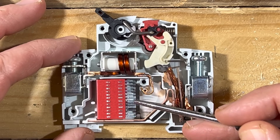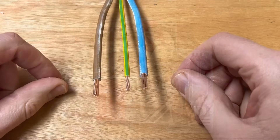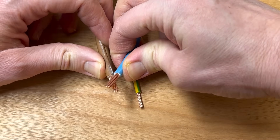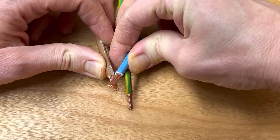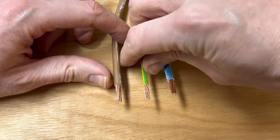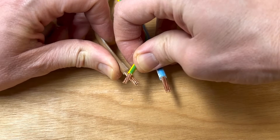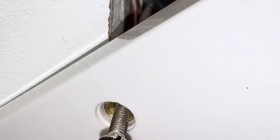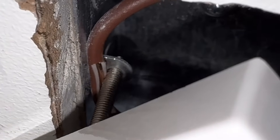The most likely time large currents generate arcs requiring chopping up is when a fault of negligible impedance has occurred. It's enough to know that it makes really large currents flow — a sign that something's gone horribly wrong in a circuit. The bi-metallic strip will eventually disconnect this type of fault, but it will take some time, and that's just not good enough.